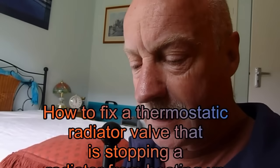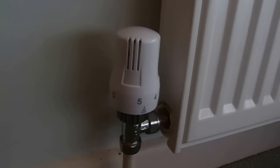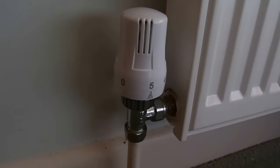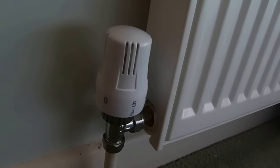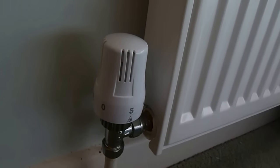Hi guys and girls, out on the case again. I'm going to show you another fault that can happen with your radiators when you find you've got one that's not getting hot. This is to do with thermostatic radiator valves like these here. That's a thermo rad valve, it's on full. Sometimes you find that it's not getting hot. If you've already checked the air valve and it's full up, and you check the other end of the radiator to make sure the lock shield is fully on with the pliers, then it could be this valve.